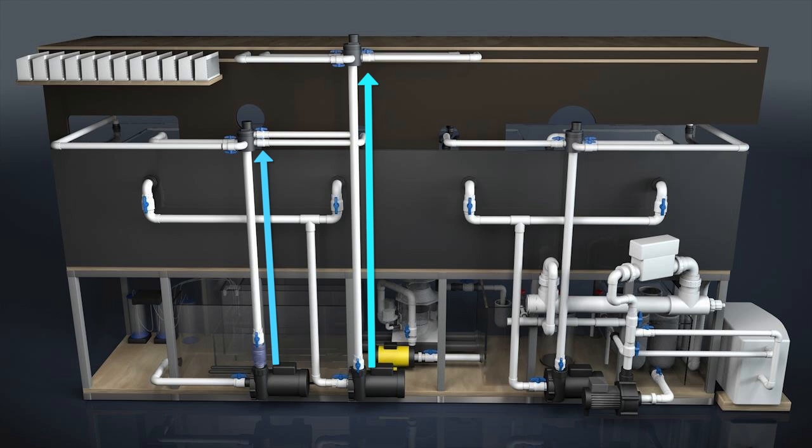They're all Wave 2 1.5 horsepower pumps by WLIM Corp. You'll notice I have a two-inch ball valve on the inlet of the pump. Above it I have a check valve to prevent water from draining down from the tank into the sumps in the event of a power failure, and I have a ball valve above that. The purpose of these two ball valves is that I can shut them off if I need to switch out or isolate the pump to work on it.